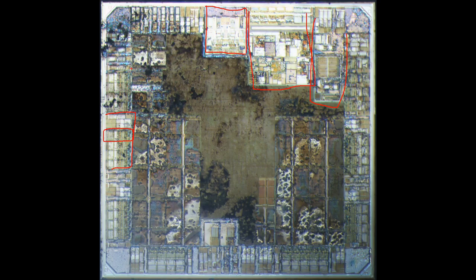The real contribution of the actual Pi is in the gray area. These are digital gates in this very indistinct area — it's hundreds of thousands of gates, potentially even millions of gates. This is the function. It was all written probably in a language called Verilog, and then it's compiled down to gates, then placed and routed automatically in this section. This is what really gives the chip its personality, and this is what modern ASIC design looks like.